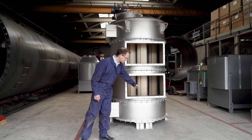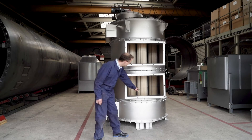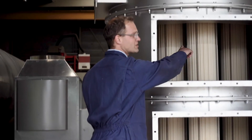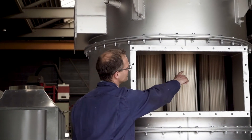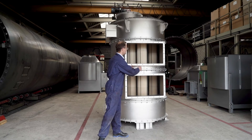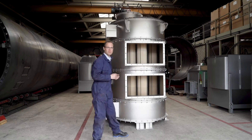Cold combustion air is entering via this nozzle. It goes in between the tubes, flows upwards, and collects the heat from the flue gases. You can see multiple bundles where the air is distributed around and is gathered from this nozzle again.